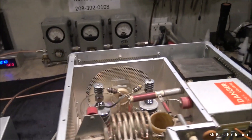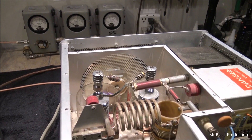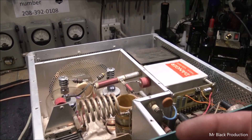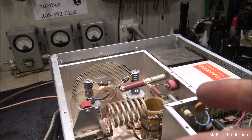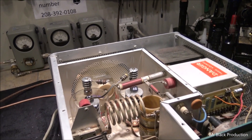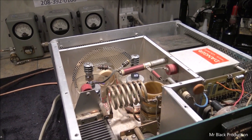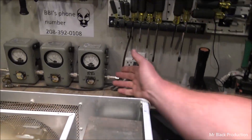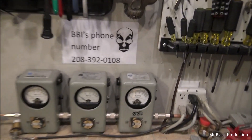The other thing I did was take your fan all apart and cleaned all the bushings. You know how quiet it is now? When it first came in here it was really loud. I de-gunked the bushings, de-oiled it, re-lubed it, put it all back together and remounted it. This thing works like a freaking rocket ship now.